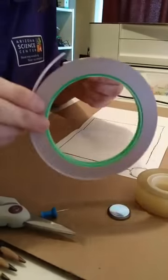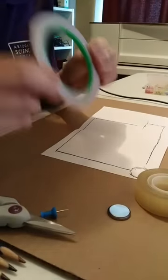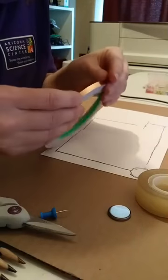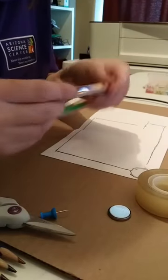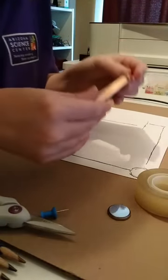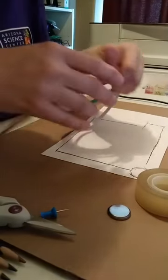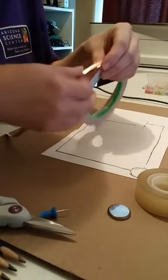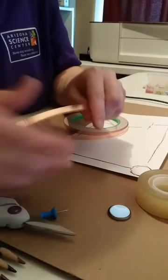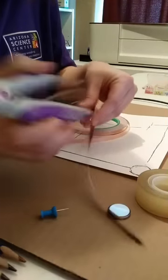I've got my copper tape — copper foil tape. You can order it online. One of the things I try to make sure when I'm ordering this is I try to get copper tape that has the adhesive, the sticky side, also conductive. Just in case you get any rips or tears while you're doing this, because if you cut tiny bits and overlay it and the adhesive isn't conductive, your circuit won't work. You want this to be conductive, so I try to make sure I get copper tape with conductive adhesive. But I'll also show you a trick if you have one that doesn't have conductive adhesive — you can easily solve that.